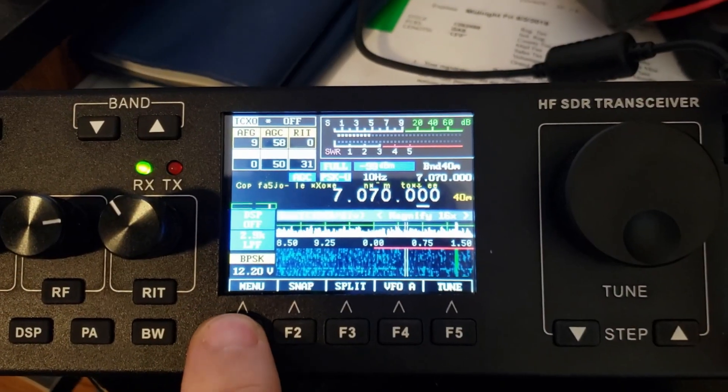When I put my flash drive in, it said it couldn't find the right bootloader — it was looking for a different name. The bootloader file is called BL-HF-MCHF, but it was looking for BL-HF-SDR. So I changed the name of the file. Worst case I brick the radio, but hopefully I'd be able to fall back to the old firmware. It didn't brick it — it worked.